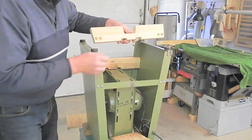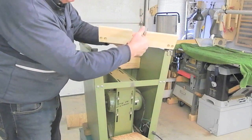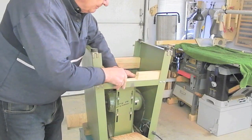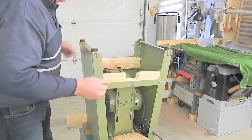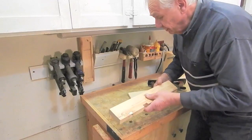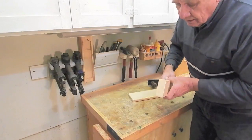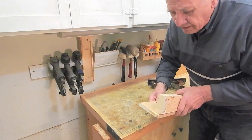The front cross piece needs to have notches cut for the frame members, but also a notch cut for the extend-retract pedal arm, which we'll see in a little more detail later on. I'll take a few strokes with a plane to chamfer the underside of the pivot blocks where the caster boards pivot.